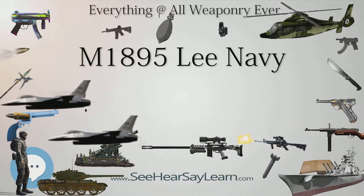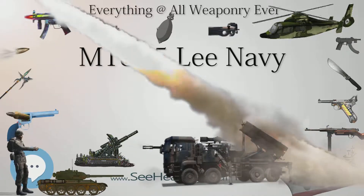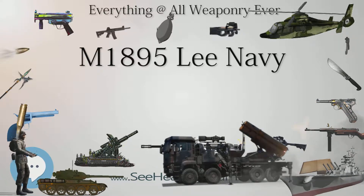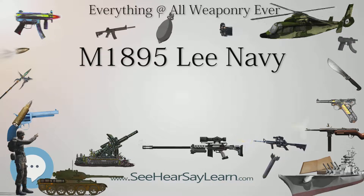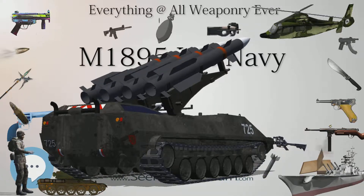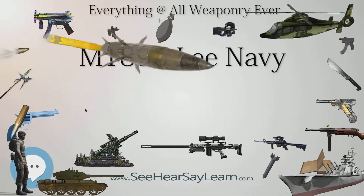The rifle has a safety located on the top of the receiver, which is released by pushing down with the thumb on the safety button. Unlike many other military rifles of the day, the Lee was not fitted with a turning bolt. Though frequently described as a straight-pull action, the M1895 Lee actually uses a camming action in which a steel wedge or locking block beneath the bolt is forced into a recessed area in the receiver. Pulling the operating handle back causes the bolt to rock back and upwards, freeing a locking stud on the receiver and unlocking the bolt. Once the rather odd up-and-back bolt movement was mastered, and as long as the action was clean and well lubricated, it worked fairly well, though the slightly inclined opening stroke proved awkward for some men when the rifle was operated from the shoulder. Despite this, the Navy's chief of ordnance noted with approval that the Lee rifle could be fired with great rapidity, achieving a rate of fire considerably faster than most existing turn-bolt rifles of the day.